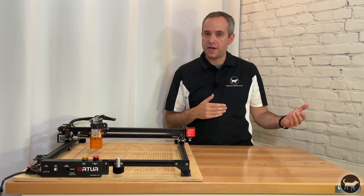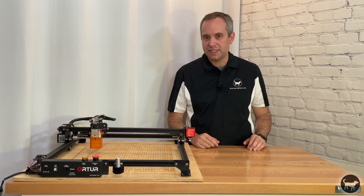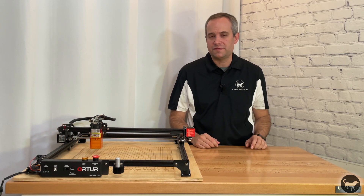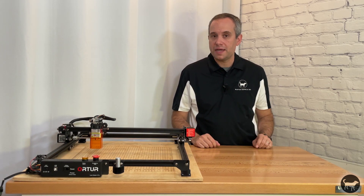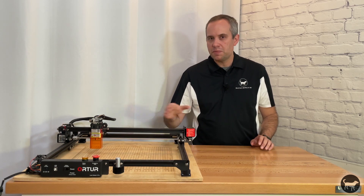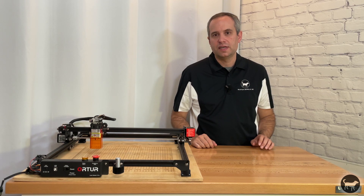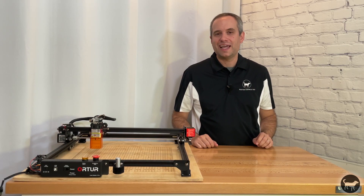Before my final thoughts, I wanted to go over some troubleshooting issues I ran into. I should note that I received this machine slightly before its release date, so some things may have been fixed since then. The issue I found was that I needed to upgrade the firmware. The version installed was a few revisions back, and the machine would throw up an alarm during a burn because the machine's motion was setting off the bump detector. The firmware I had was not allowing me to change the bump sensor sensitivity, so I needed an upgrade. I would not recommend doing a firmware upgrade unless you're having a specific issue — if it ain't broke, don't fix it. In my case, it was broke, so I fixed it. The instructions for updating the firmware were pretty straightforward and easy to follow.